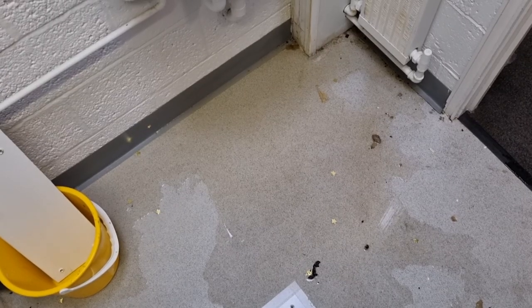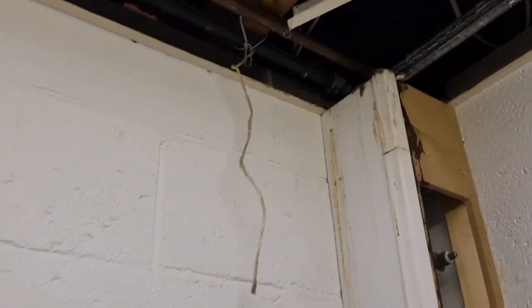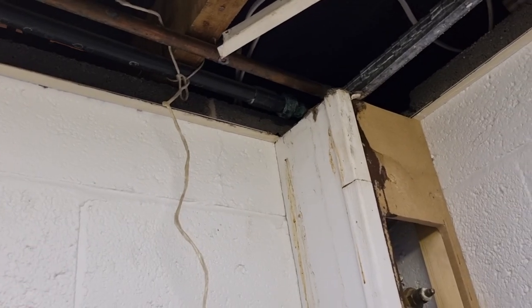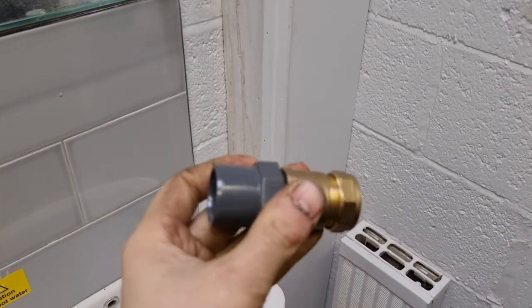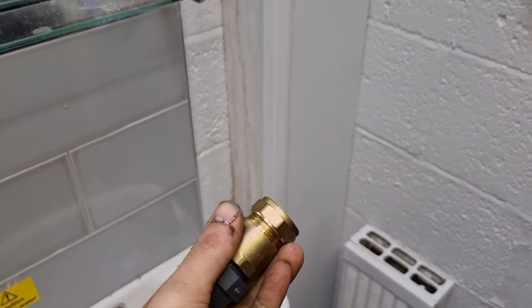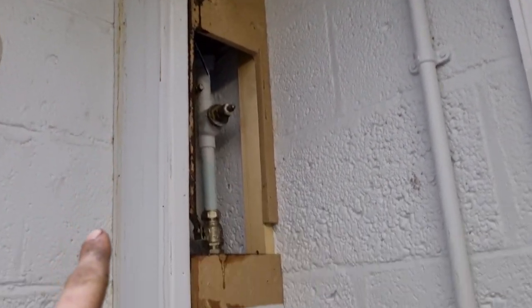It's Saturday morning and I've got this little thing to repair. What we've got is duro pipe and it's leaking where it goes to the copper. I've got a new adapter to install — it actually goes on to a tee, but it's capped off just past there. We're going to do away with a dead leg and then connect back onto the cold in the box. Hopefully we've got all the right stuff; we'll get the water off and crack on. What I'm going to do is cut it back here and put a new adapter.